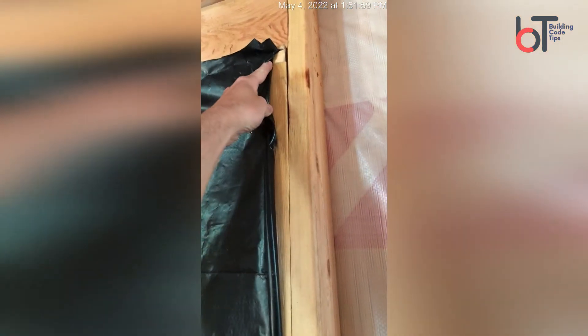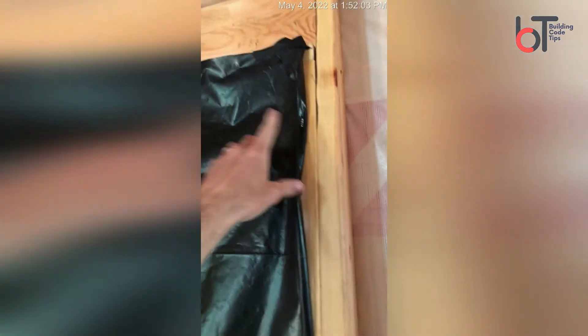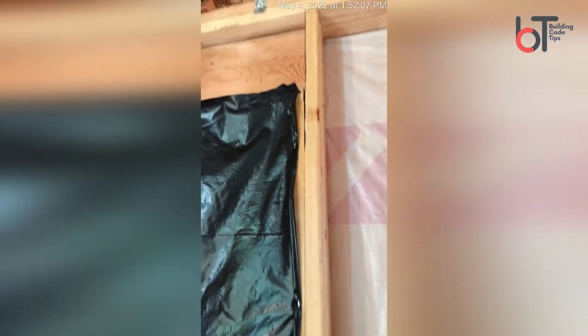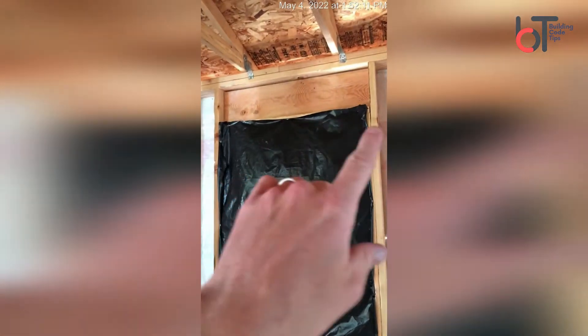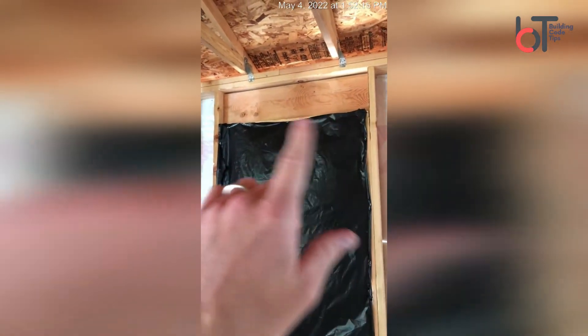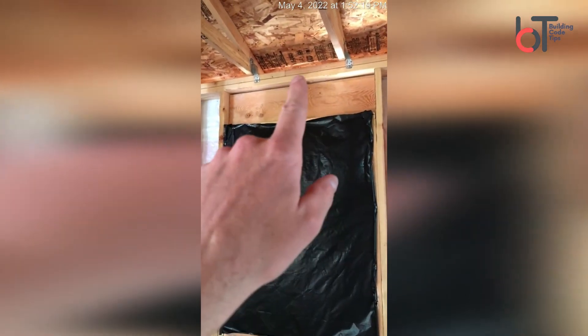You can see right here, this is just a single — there's not a second one right here. One on either side. And then this right here is called a king stud. The king stud goes all the way up. This particular header has single jack studs on either side with a king stud on either side — that's typical installation. It looks like it has double top plates and it is holding up a roof.